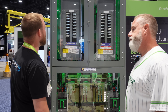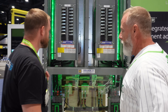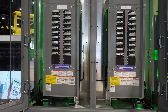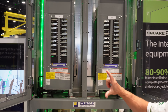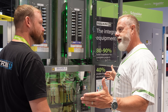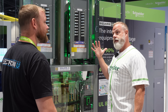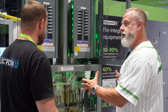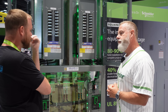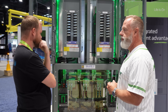Is there anything internally that we need to know about? When you think about electrical installation, traditionally you can't stack panels above a transformer, so that configuration spreads out. We think on average, for two panels and a transformer, it's about 80 to 90 inches of wall space. Because these panels are front-lined based off a bracket, now we're in a 42-inch structure. So we're saving space — we save on average about two-thirds of wall space compared to traditional installation.